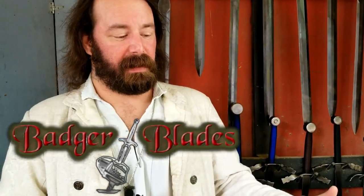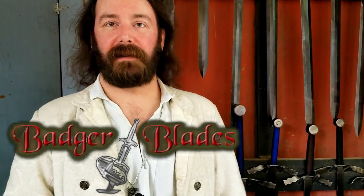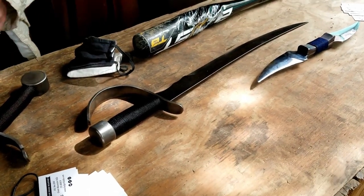What we do is we heat treat it in liquid salt. It gets tempered in an oven, usually for about 6 to 8 hours. It's all oil bath. When it comes out, it turns out like this, giving it this nice dark color. It's unintentional, it's just a bluing process because of the salt and the oil.